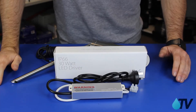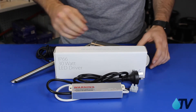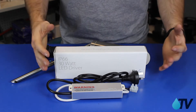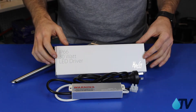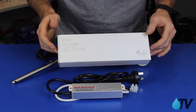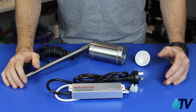You're watching SunShower TV. When you're trying to work out how many lights you can put on a single circuit, you're going to have a certain number of lights and they're all going to be a certain wattage. But what it all has to run through is an LED driver. What I have right here is a Havit 30 watt LED driver — that's 12 volt DC, constant voltage. This is what all of your lights on any particular circuit are going to run through.